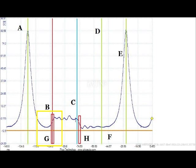As the piston nears BDC of the power stroke, the exhaust valve opens and results in the ramp up in pressure you see at G. As a rule of thumb, the BDC line should intersect that upward ramp midway. Too much outside of the box indicates a late or early opening, perhaps caused by an out-of-time exhaust cam or worn cam lobe. Next, the piston nears TDC of the exhaust stroke and the intake valve opens. Since both valves are open for a time together, you won't quite see the same ramp down as you did with the exhaust alone. Instead, look for the center of the ramp to occur shortly after TDC.